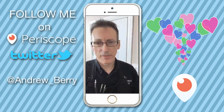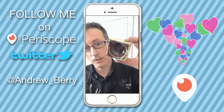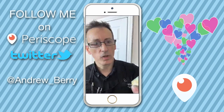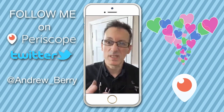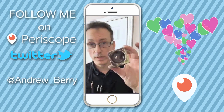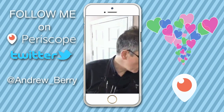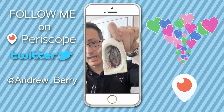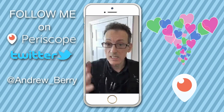This is a crucible we've melted down in many times. You can see all this area here has a load of sort of gunk — that comes out of all the metal: the dirt, bits of carbon, dead skin, burnt perfume from chains and other things you'd melt down — it gets trapped in with all the borax. You can carry on using that, no problem at all. Likewise, this is one of our casting crucibles — in here it's nicely glass-like and nicely prepared.